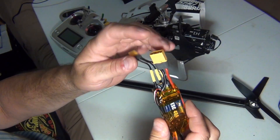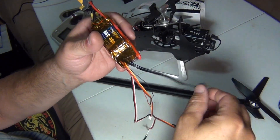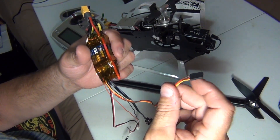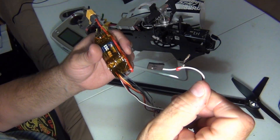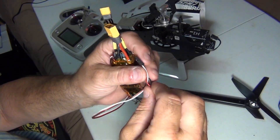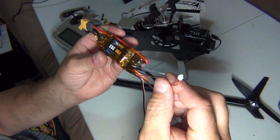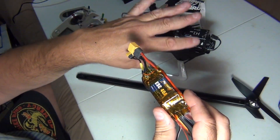Here's the main motor connection, here's your battery connection. You have your tail connection, which I stole from the other ESC. You have the telemetry. You have servo wires — this is a servo wire for the main motor, this is a servo wire for the tail. I haven't removed the red and black wire — you don't need those. You just need the signal wire, which is the white wire. So you remove those, get them out of the way. Your telemetry wire goes directly to the battery side — it just keeps track of the power going to the unit itself and the H1.